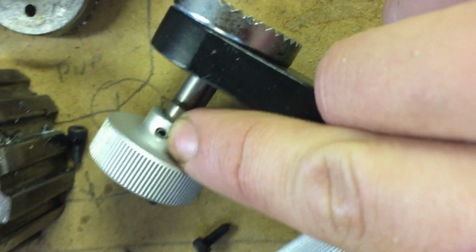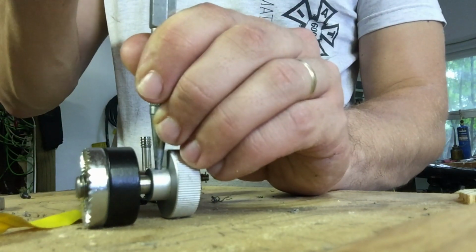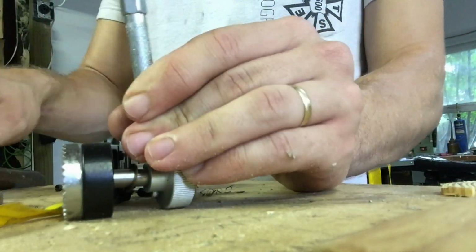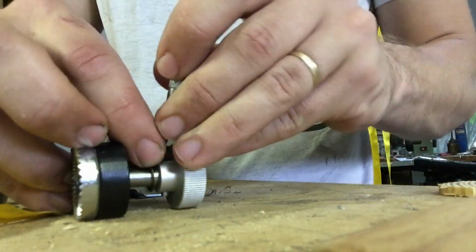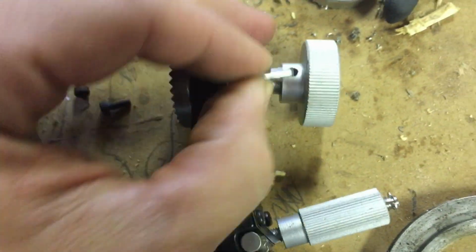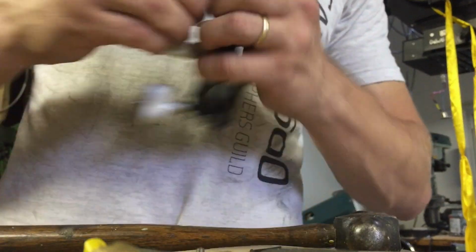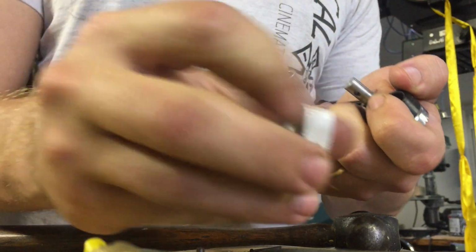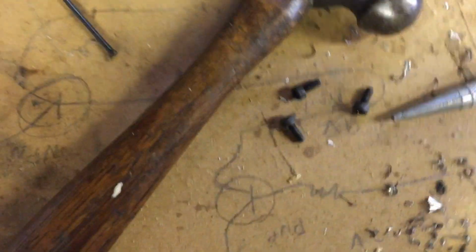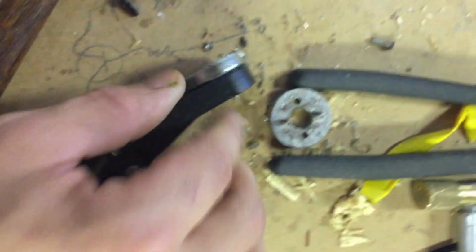Take out the bolts. This little thumb screw there has a little spacer in there to lock it, so I'm gonna have to hammer that out. There we go. Pop that pin out. That's the pin. The little guy came from out of there. Handy operation. Pop! Comes right off. There's that. And then, all right, now we get to go over to the blowtorch.